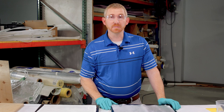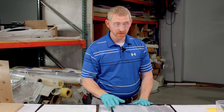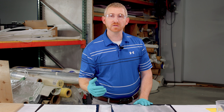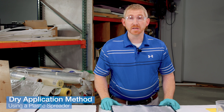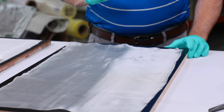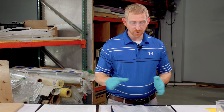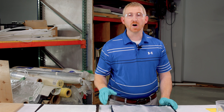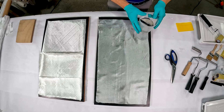Now we're at the stage of applying the epoxy to the surface. We have a lightweight fiberglass cloth — four ounces per square yard; anything up to about 12 ounces per square yard is considered lightweight. This first method is applying the fiberglass on the surface while it is dry — meaning there's no epoxy on the substrate. It's prepped: you've sanded the surface for good adhesion and removed any sanding dust by wiping or vacuuming. Once you get the glass laid out with no wrinkles, I'm going to pour just a small puddle of epoxy on the surface.